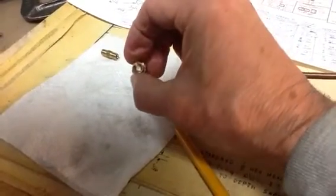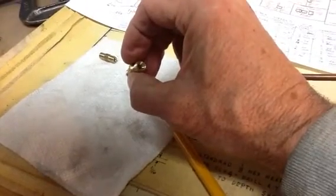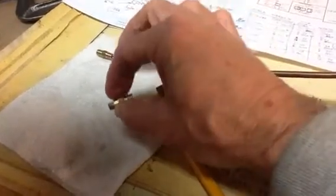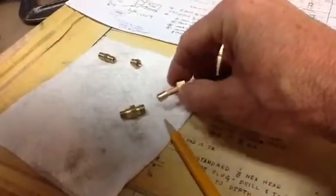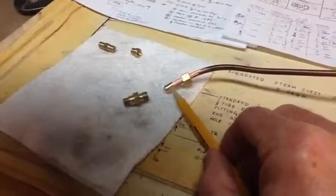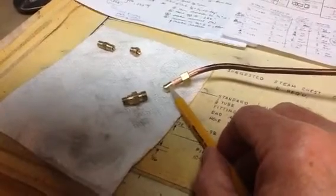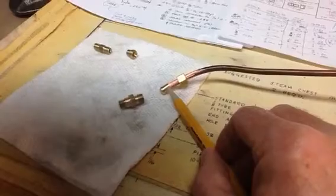As you can see, I through-hole drilled an 1/8 inch hole, and I also used a center drill to make a 60-degree conical opening in the end of it. The purpose of the conical opening is to fit this male brass fitting. Started out with a piece of 5/16 inch round brass. I turned it down. This shoulder here is the outside diameter of 1/4 of an inch.